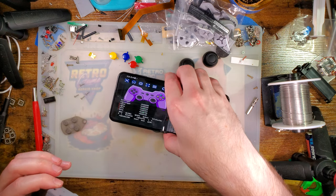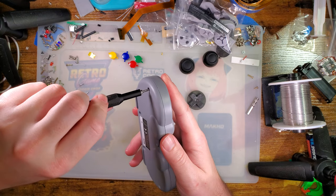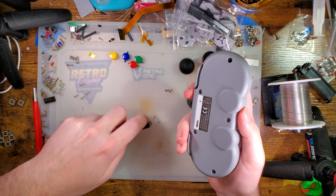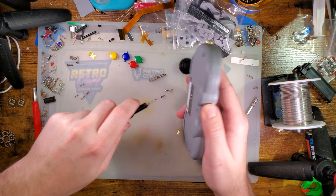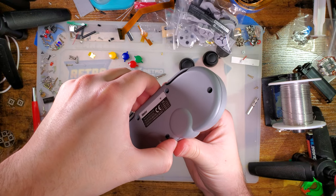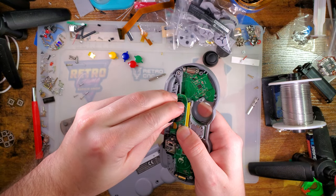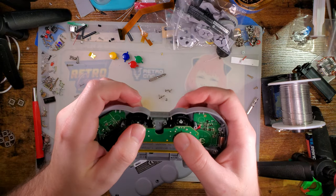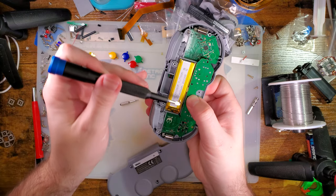I'll link to the printables page — Thingiverse, I don't recall — and I'm sorry, I'm totally forgetting the name of the person who published this, but I'll throw a link in the description if you want to check it out. I have no idea how thick that part is supposed to be, but it printed perfectly fine with PETG on my Ender 3 Pro. I just set it to dynamic quality, it ended up laying one layer down, and I enabled ironing to make sure it was nice and smooth and strong. Seems good so far. I'm going to get this thing reassembled — flipping this part back in, getting the sticks lined up — and then here are our four short screws.